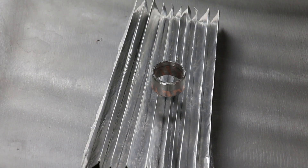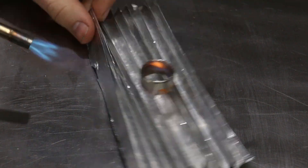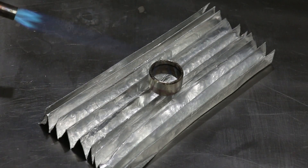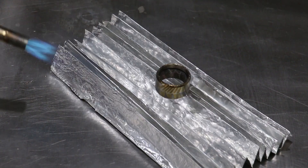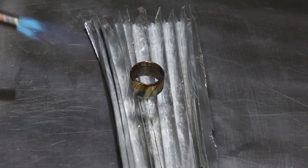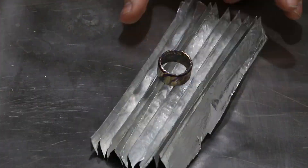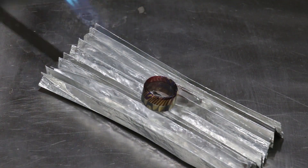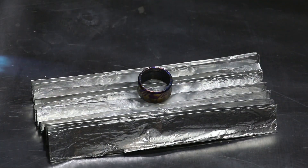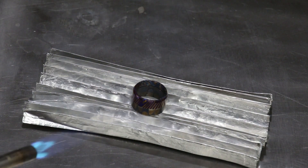Now I'm ready to flame anodize the tymascus, and it's important I do this now because if I add the carbon fiber liner to it, it will completely destroy the ring if I try to hit it with a blowtorch for that long. It'll totally burn up all the adhesive I used to put this together, as well as destroy the resin that is impregnated into the carbon fiber, which is what holds it together. So I've only got one shot at this and I don't want to scratch it from here on out, because if I do I'm going to have to take out the carbon fiber liner, then reheat treat it, and then put another carbon fiber back in — that's going to be no fun at all.